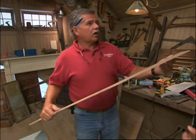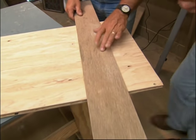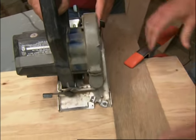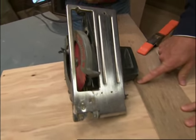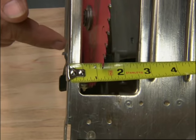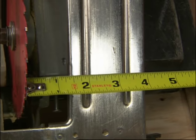Start with a straight piece of scrap wood. Use it as a guide to run your saw along. Clamp it to whatever you want to cut, and run your saw base along that straight edge. The important thing you have to know is that you have to measure for the offset of the blade in relationship to the plate. This side, it's an inch and an eighth. This side, it's four inches.